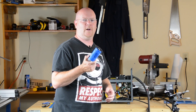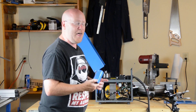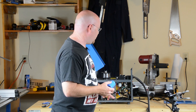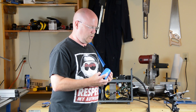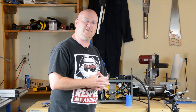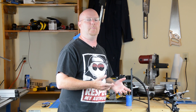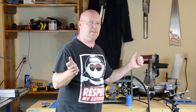Next is adding the capacitor. We need to find somewhere inside the box to put it, and that turns out to be relatively easy. There's a lot of empty space up front between the transformer and underneath the drive controls for the wire feed, so this thing is going to stand just inside the box along the front. I think we're going to go old-school simple on mounting — drill a couple of holes in the front and wire tie it in place.